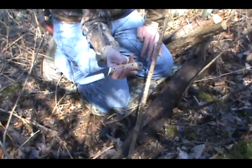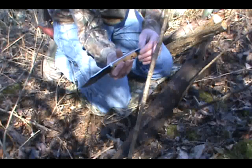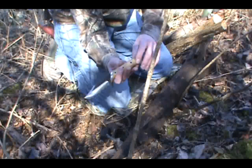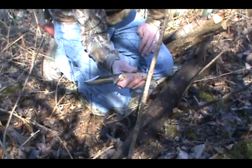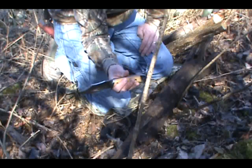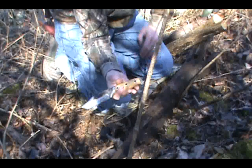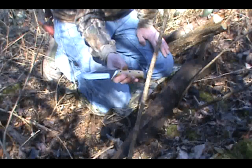That's not really to take the place of a pommel plate — that's more for cracking melons and coconuts. I don't really like making these exposed tangs to hit on the back, because there's still a chance you can hit your handle material and bust it off. The pommel plate is the way to go if you're wanting to do stuff like that. This can take some force on the back; just know that you run the risk of possibly knocking your handle scales off.